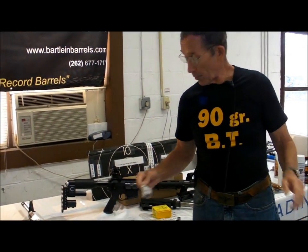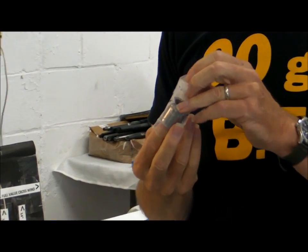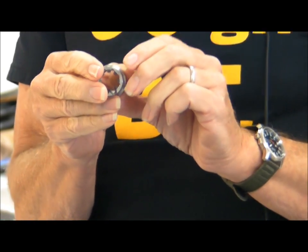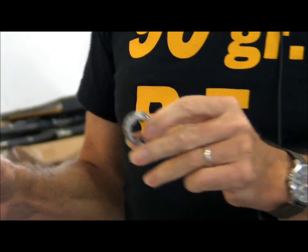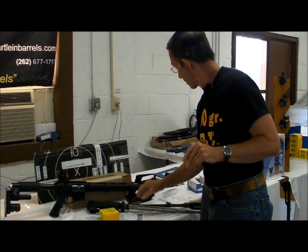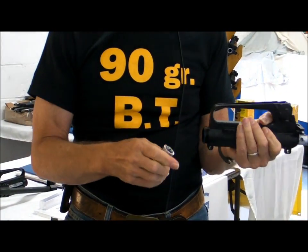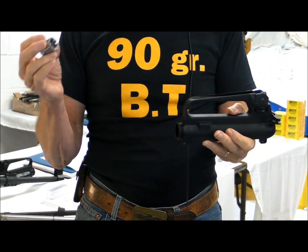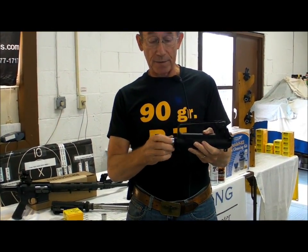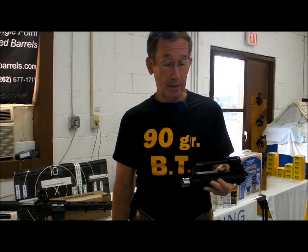The more modern and better way is to replace the barrel extension with one from Bat Machine. Bat Machine makes their extensions fatter so they require a press fit into the upper receiver, which eliminates all the fooling around with shim stock. You would still use green Loctite to seal it in place, and you're looking for a very tight fit — as you can see, I can barely pull this one out. That's the kind of fit you're looking for. Bat Machine has these in different sizes, and when I get a customer's gun in, I simply go through my box of different size barrel extensions until I get one that fits really tight.